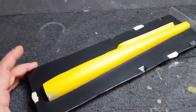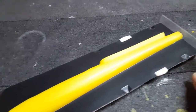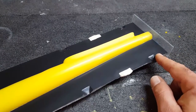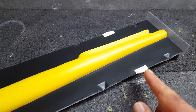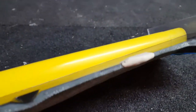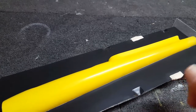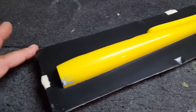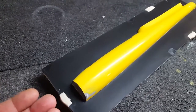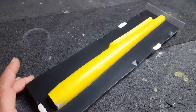I did a little more work on this to get it ready for the other half of the mold. I put another gate or dam here — I just used a piece of plastic this time so I didn't have to mess with the covering wrinkling when I glued it to the first half of the mold. Then I used a little bit of clay here, here, and here — just real thin, nothing too thick — just to make a few little inserts where I can stick a wedge in and pry the mold apart after I make a part, to help get the part out of the mold a little easier. When I lay up the other half and pull it off, I'll clean the clay out and I'll have little wedge inserts in the other half. It's got a bunch of coats of mold release on it so it's ready to go now, and hopefully I can get this thing done pretty soon.